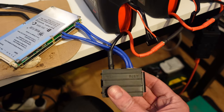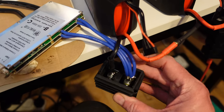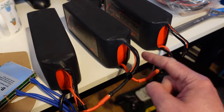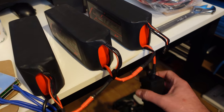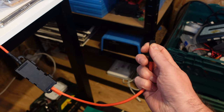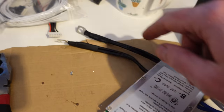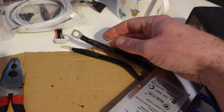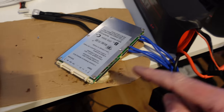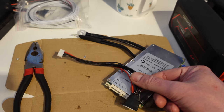BMS — we've done a little connector block, basically like a bus bar, going to one side of the battery. We did end up removing those XT-90s. We've got a 200 amp fuse on the other end, and a ring terminal with insulation for safety for now — that's going to go straight onto the controller. We've got two positives and negatives coming out of the BMS with some pretty juicy cable. I'm going to link those two together. Next we've just got to do the balance leads — link up all the balance connectors to the BMS using these adapters.